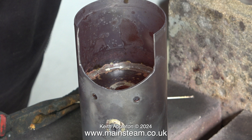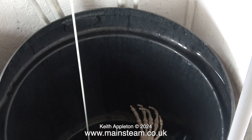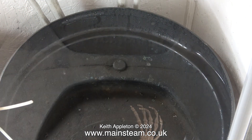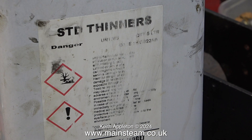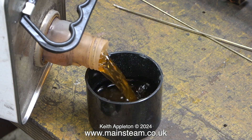That's it — I think it should be fine, and here's a shot of the part cooling. A miniature steam boiler is very different to silver soldering a piece of pipe, so by the time I put it in the acid bath it was cool. If I were to shock the boiler by throwing it into a bucket of cold water it could crack the joints. With the boiler safely in the acid bath I can now turn my attention to removing the black paint from the water gauge fittings.